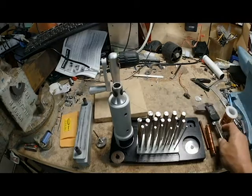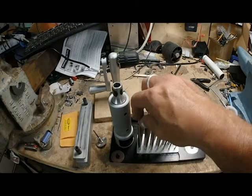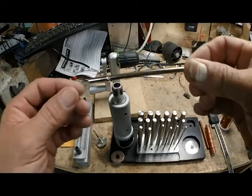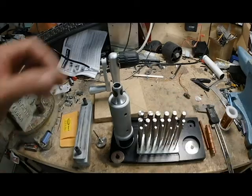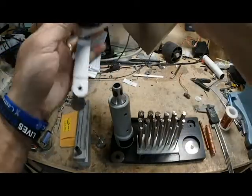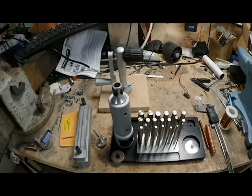The kit goes all the way up to a 12 millimeter, which is almost a full half inch, and it's pretty accurate. From four and a half on up they start putting a little hole in them to hold your wire, or you can just slide them in between the two chuck pieces and they hold themselves in place. You can use a drill - I use my Hitachi cordless drill on slow speed. You've got to make sure to go slow because it will outrun you.